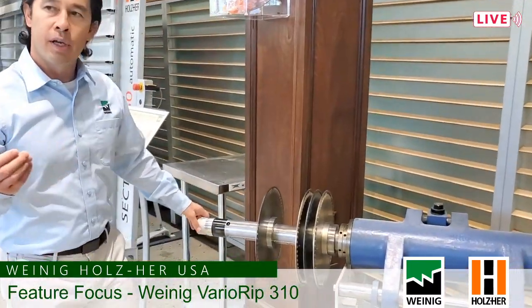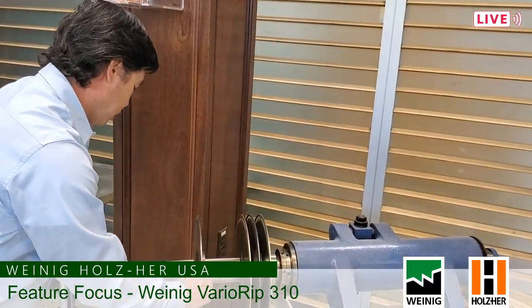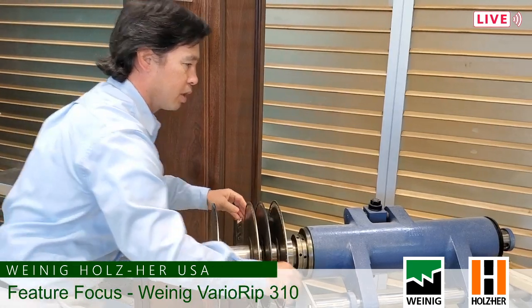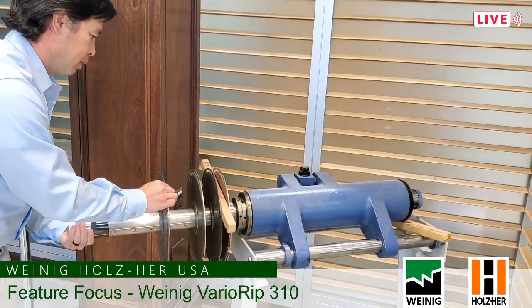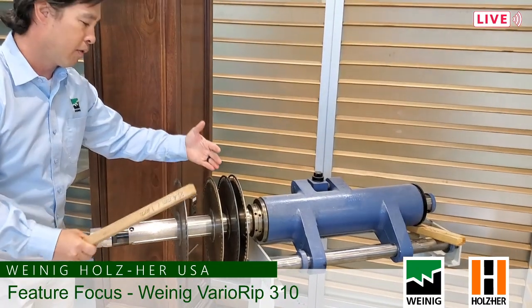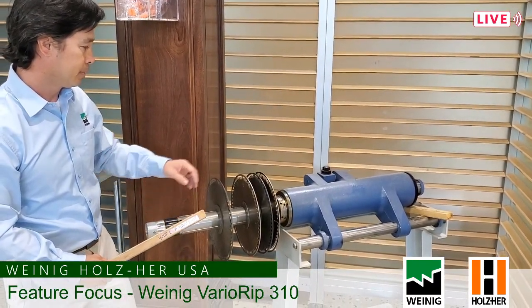For demonstration purposes, we've removed an arbor out of one of our machines with the quick fix arbor. Right now these blades are locked into position. But if we ever wanted to change any of these fixed pockets, all you have to do is loosen this nut, and then you can adjust your fixed blades into position. We have little spacers you can use to help set that distance. You tighten this nut up just hand tight, and now we've got a one-inch pocket. On the moving blade saw, the outsaw side blades would keep moving. By setting up a fixed pocket like this, you're creating more strips produced per board.